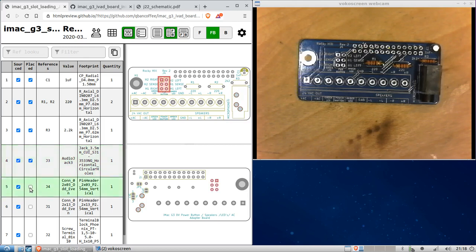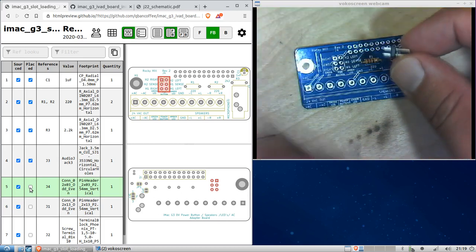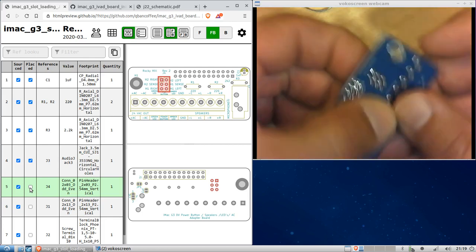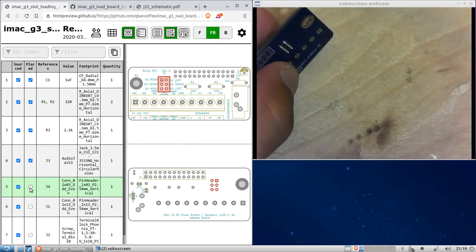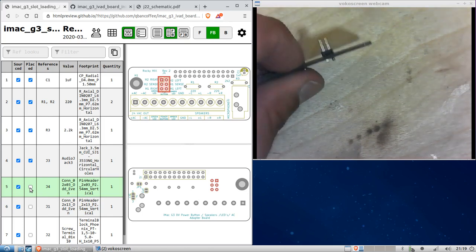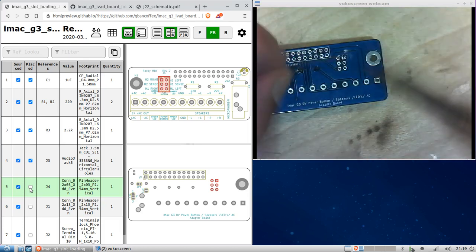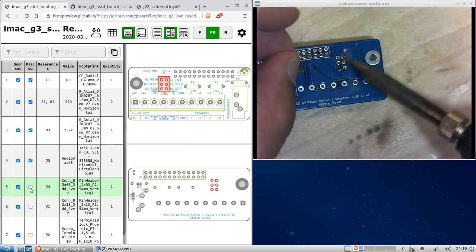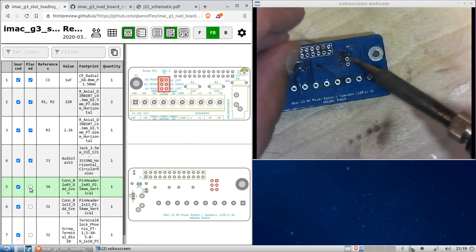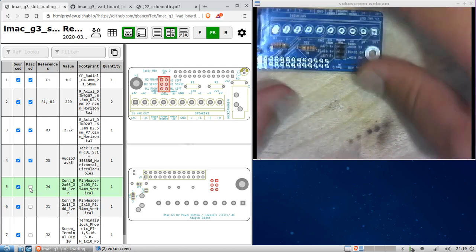Okay, there's a pin header that we're going to put in, 2x3. That guy goes here. And this time I did go out and buy it. All right, this will fall out, so we'll play the same game. Put some solder on the tip to hold it in place. Okay, and you can see there it's not going anywhere. Okay, placed.